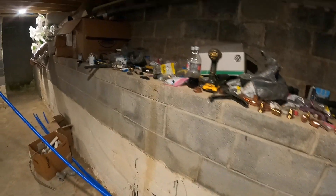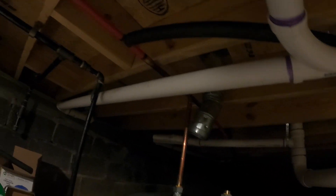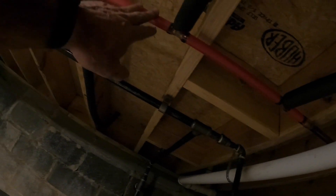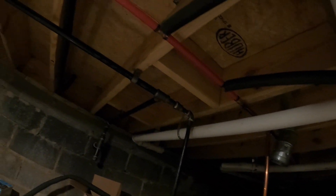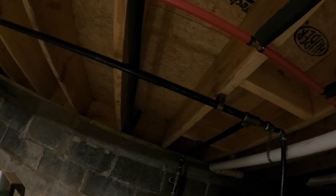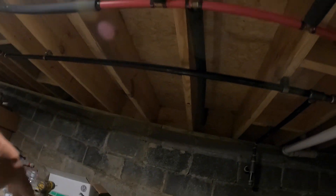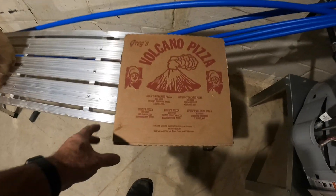I had to run out and get a couple more things. I think I'm going to go ahead and insulate the cold water lines as well. I haven't strapped any of this up yet. I bought some Rubitex that's slit that I could put over that three-quarter stuff. I'll probably wait until I test because everything else you can get to just by pulling this back. But all the half-inch stuff is insulated. We've had to have some pizza.